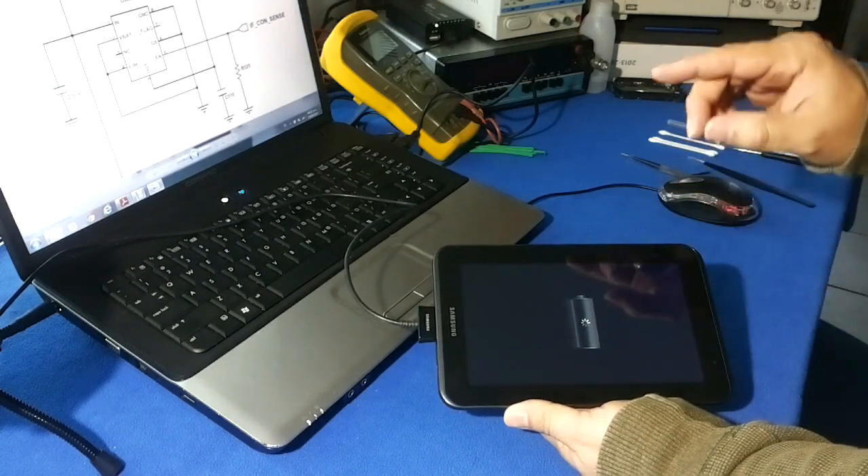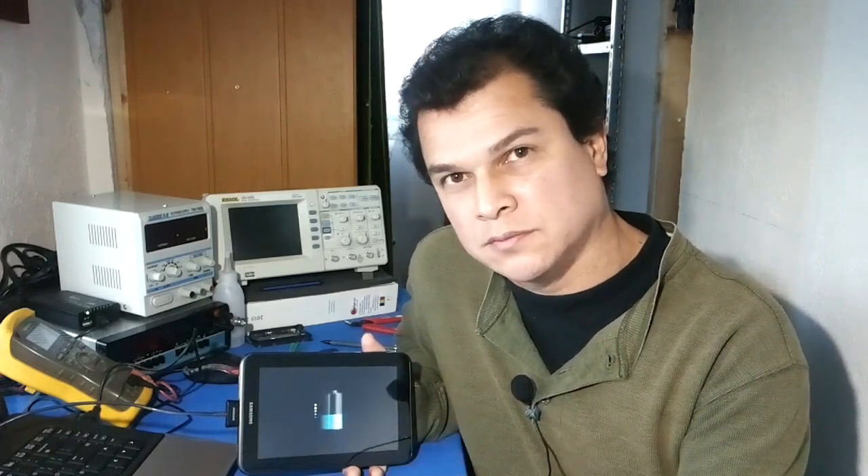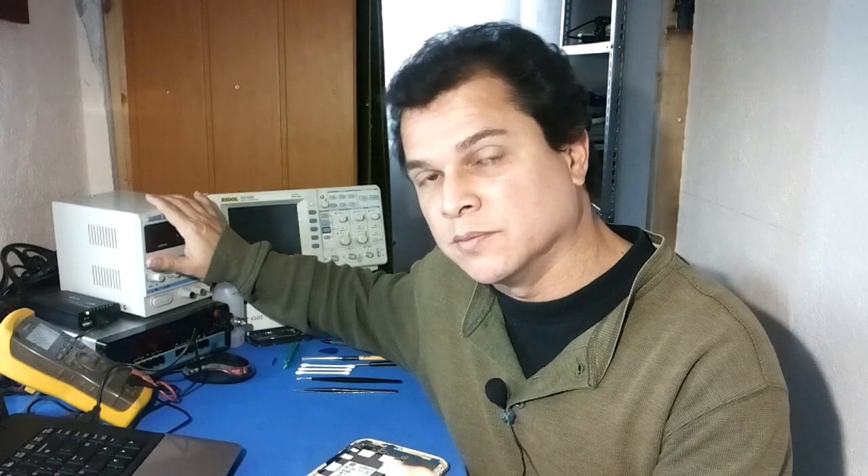Remember how it tried to charge and went off? Let's see what is going on now — it's charging. Let me tell you: taking the battery out for 10 seconds and putting it back, or putting it in an external charger to restore the operating voltage, is not the solution. You are giving your client an appointment to come back with the tablet discharged again, because sooner or later they will discharge it again. The only way to solve this problem is making a bypass as I did. Then you are fixing the tablet — not transferring the problem back to the client. Thanks for watching.